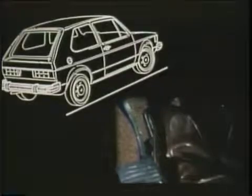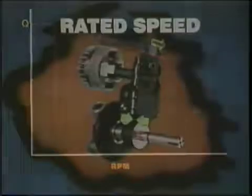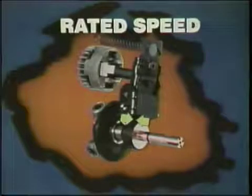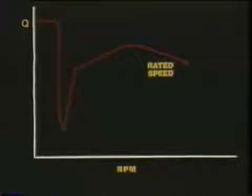In part, speed is determined by load. Climbing a hill, full load may be at some partial speed between minimum and maximum. As the RPM approaches rated speed, what happens? At rated speed and full load, the spring force just balances the flyweight force, holding the metering sleeve for rated speed delivery. Full load continues at rated speed, but no more.